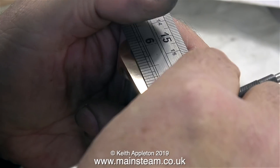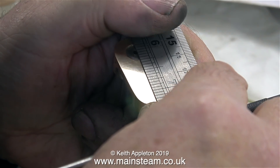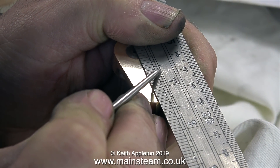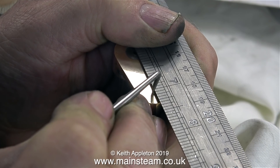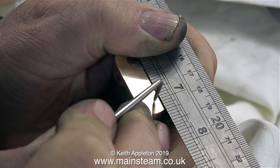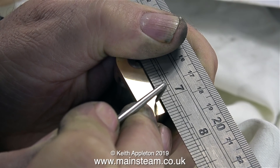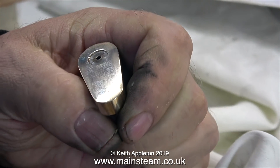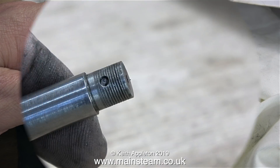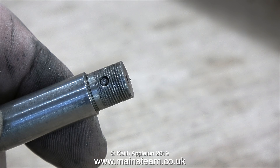I need to make a mark one inch from the centre of the crankshaft to drill a hole for the crank pin. Here's a good tip: don't use the edge of the ruler — put the ruler somewhere in the middle so it balances, that way you don't have to hold it in place. The gap from 0 to 1 is one inch and the gap from 6 to 7 is also one inch. This is only a temporary mark to give me some idea of how it's going to look — I still need to machine the other side of the crank web.